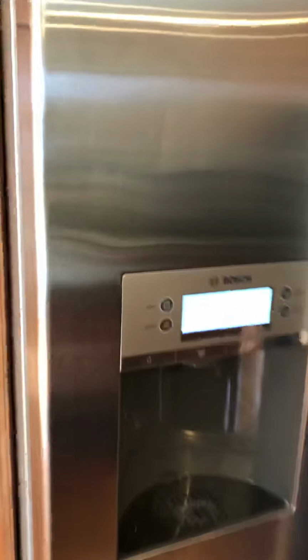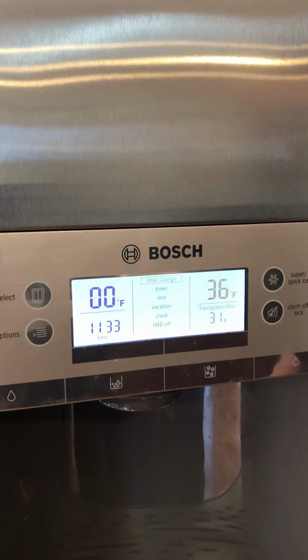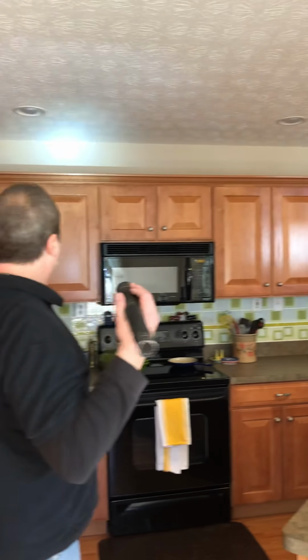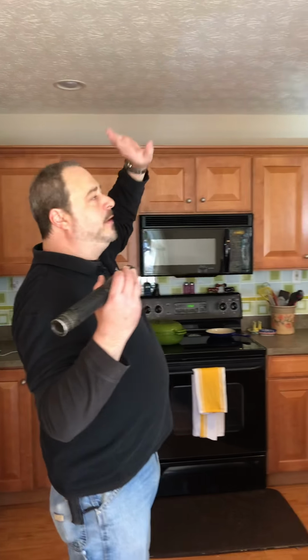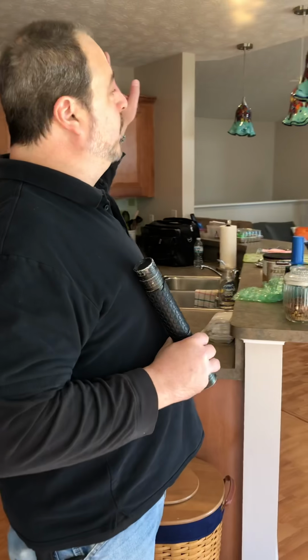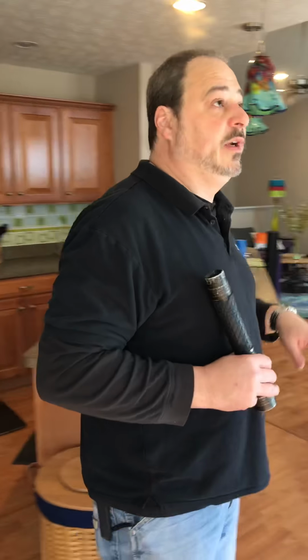Looking for any of the items as we go through on a general basis from here on out. What we're going to be looking for are water spots, any kind of water intrusion, repair areas. All these are stomp ceilings, so if they did have a repair or painted a spot, or even just a water spot, it would stand out like a sore thumb. So if you ever tried to patch one of these stomp ceilings, it's almost next to impossible to match, so it would stand out. And of course we don't have another story above us, so really all this is just roof line and exposed roofing area.